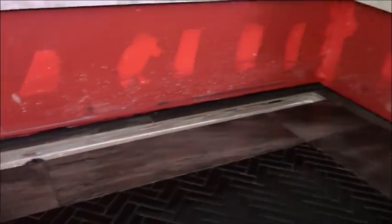Anytime you do any shower, not just a curbless shower, you should grout before you set your last tile. So the grout will get pushed up into that crack, that void that you left in the back. It doesn't matter that it's smoothed out because it will never be seen and never be used. But yeah, push that grout back inside where the tile meets the liner.